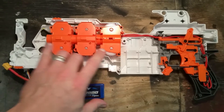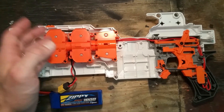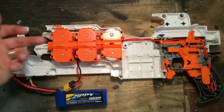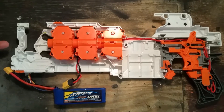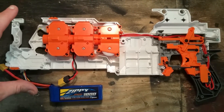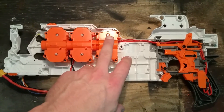So I tore the whole thing apart, took the flywheel cages all apart and cut them down, put them back together, and used a piece of 9/16" brass to line them up all the way through. Then I changed the motor configuration in addition to the cage geometry.